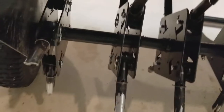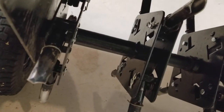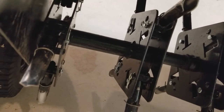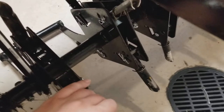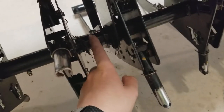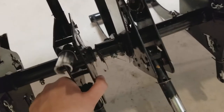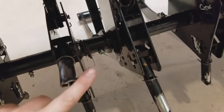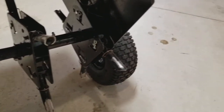The other thing I mentioned in that video that I didn't like is this side plate here and this first spool — it's metal against metal, there's no plastic washer there. I would like to see a plastic washer there, as well as between this spool and this foot lever, which is also just metal on metal. Same thing on this side between that foot lever and that outside side plate.